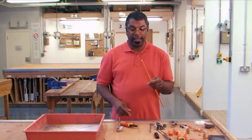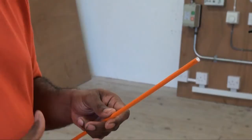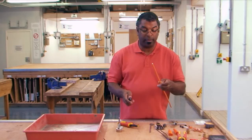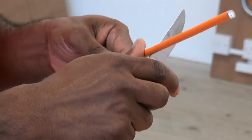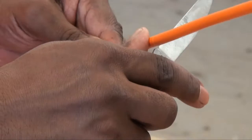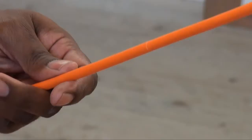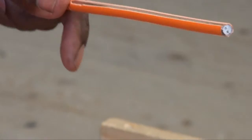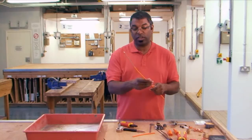The first thing we want to do is strip the insulation off. You'll have to work out how much conductor you'll need in order to wire what you're going to wire. To remove the outer sheathing, just going to use a knife and gently score around. If I was really mating this up with something I would measure the length I'd want so I could cut it more accurately. Now with the knife pointing away from me, I'm just going to take the outer sheath off — you'll see my scoring — just to leave the copper.